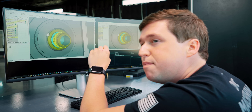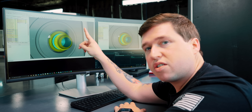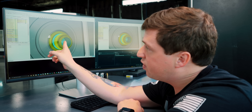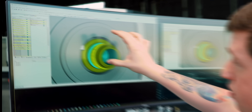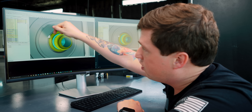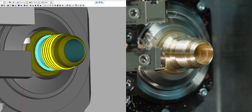Now I have to mill the hex. One thing about putting wire holes in with this strategy is you can't order the normal material size, like I said earlier. So I'm gonna come in and turn away the extra material. If you look, you're actually gonna see why I need bigger material — if you get the exact material size, the wire hole will actually kind of creep out the side a little bit. Let's run it and I'll show you what I'm talking about.